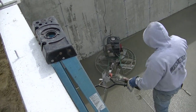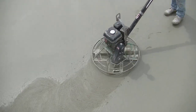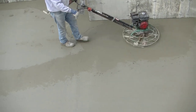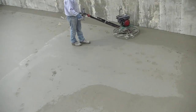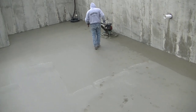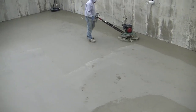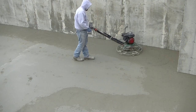Hey guys, Mike here. What Darren's going to do is start the trowel and work his way out of that shady area where it's a little softer, over to where the sun's been hitting the floor longer where it's harder and where he already did his edges. First thing he's going to do is take out most of his footprints from doing the edges — you don't want them sitting in the sun too long or they'll be hard to get out. It looks like he's got on it at just about the right time, not too early and not too late.